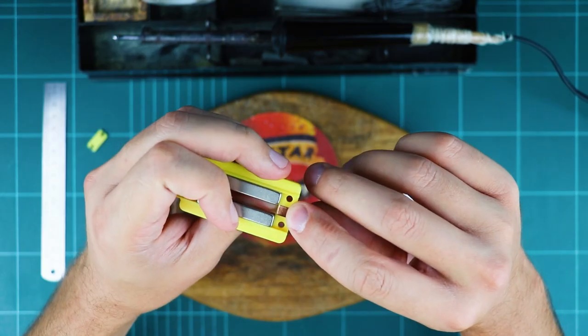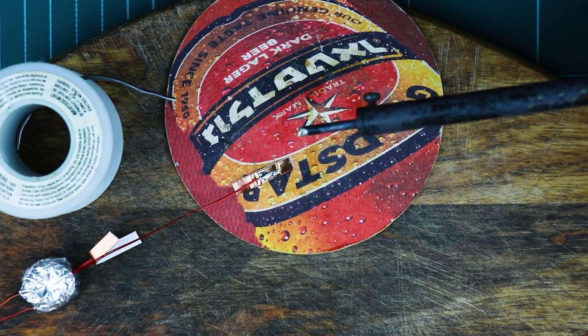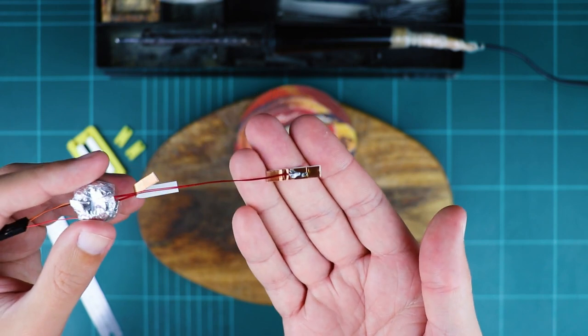Measure two pieces of copper tape for the ribbon to lie on and solder a connection wire to each. You can obviously use a piece of tin can and just super glue it on the motor. But please don't solder on the motor. The iron will simply melt those beams, so the motor will warp and collapse on itself because of the magnets.